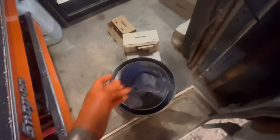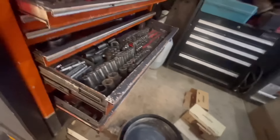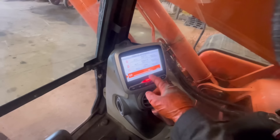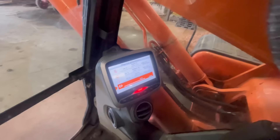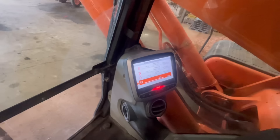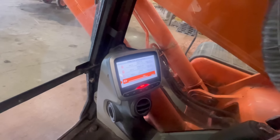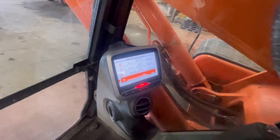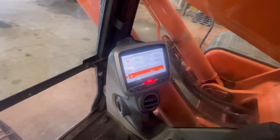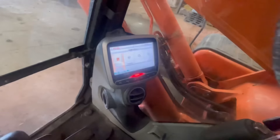While it's warming up I'll fill the slew gearbox. I've still got a wiper controller to fit, which is a back-of-cab job. The hour meter is reading four and a half thousand hours. The DPF filter has done 6,685 hours, which is probably more accurate for this machine — still quite low hours for a Dash 3. The engine oil breather — it doesn't even have one.